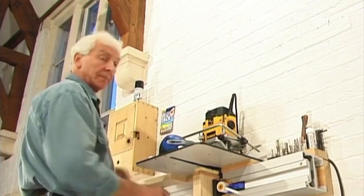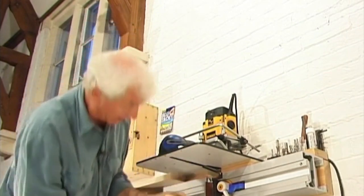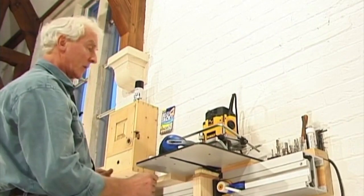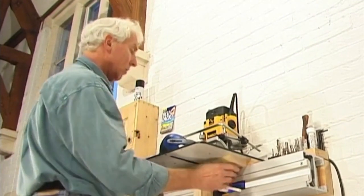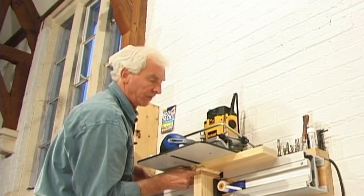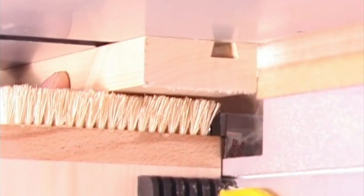The WoodRat, on the other hand, has this, the brush. Yes, it's a scrubbing brush on a stick. It's cammed in the cam clamp and will give you whatever pressure you need to keep your work in place. Either a stiff upward push to hold it still, or a gentle push as you're sliding the work through. There's now no kickback, and the bristles keep the workpiece tight against the fence. It's not rocket science, but it works beautifully.